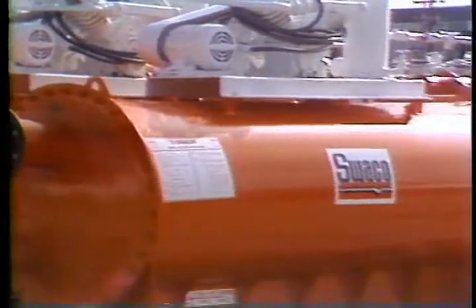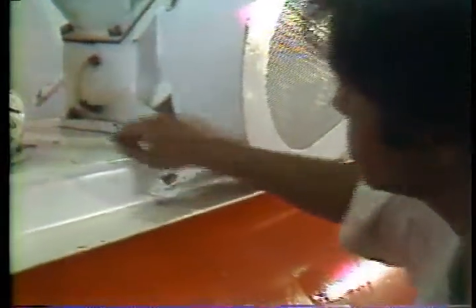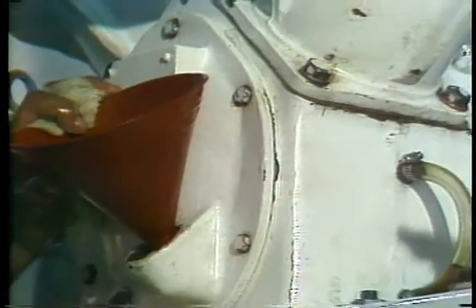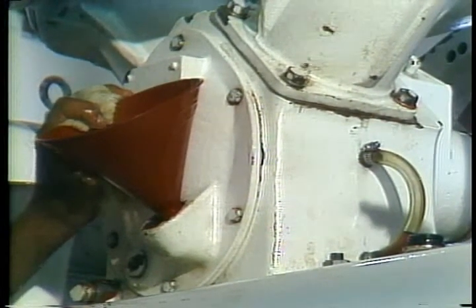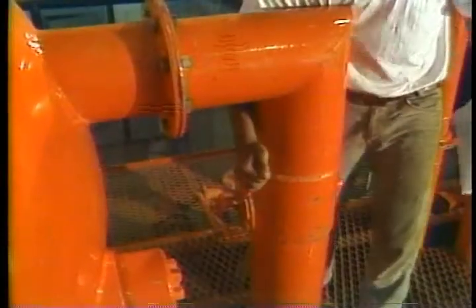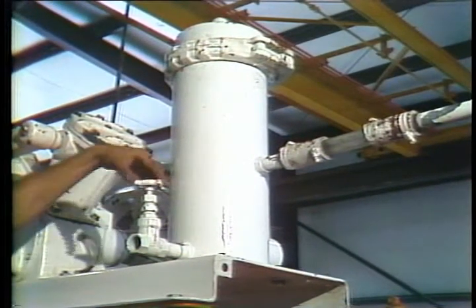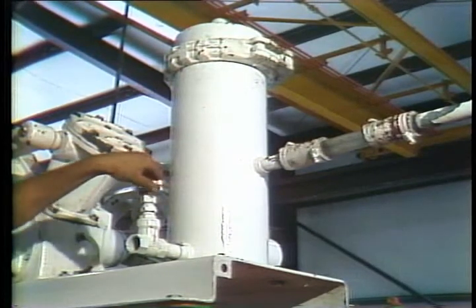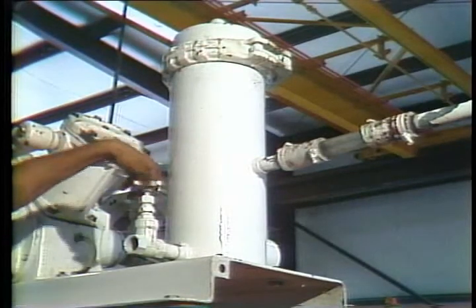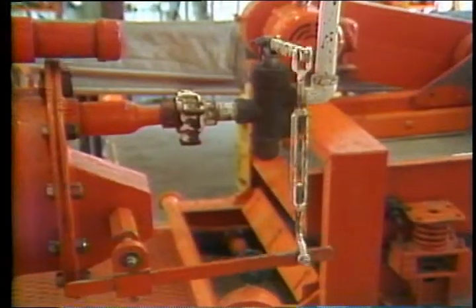Let's look at the daily pre-start and start-up procedure. First, look at the oil level in the vacuum pump — there's a clear indicating tube on the side of the pump which should be about one-third full. Check the oil to see if it's clean and moisture-free, and if it's low, add SAE 30 or 40 non-detergent oil. Next, make sure the one-inch valve is open on the vacuum line and that the butterfly valve on the suction pipe is open. Then drain the moisture out of the water trap by opening the valve and letting the water run out — be sure you shut the valve when you're through. Now you can start the vacuum pump motor and check for movement of the three-way valve, which will indicate that fluid is entering the degasser.